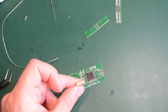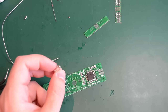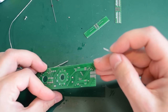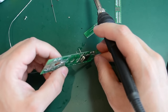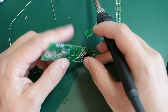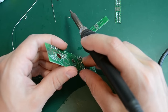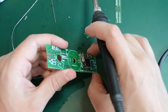I'm going to continue with the 20 pF capacitors, which are marked with 20, and they go right next to the crystal oscillator. Next I'm going to solder in the crystal oscillator — it looks like it's 11.0592 MHz. I accidentally plugged one of the holes with solder. Make sure you don't insert your crystal oscillator all the way to the bottom of the PCB because you will short the capacitors using its metal case. You just have to keep a little bit of clearance between the can of the oscillator and the capacitors underneath.